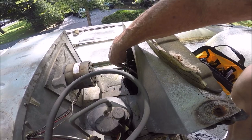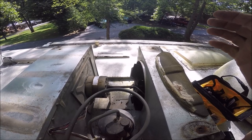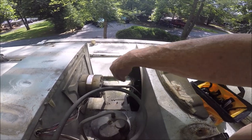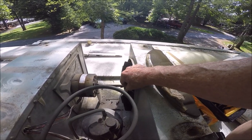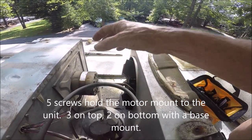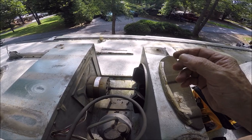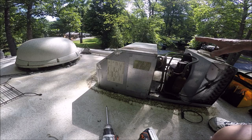This is not a hard job, it just takes a little planning. The hardest part is probably getting the motor out and getting these fan blades off. There's another one in the squirrel cage that has to come off to get access to it. I'm going to show you how to do that, and it might make your job easier. Turn the total power off to the rig — you don't want any AC power.